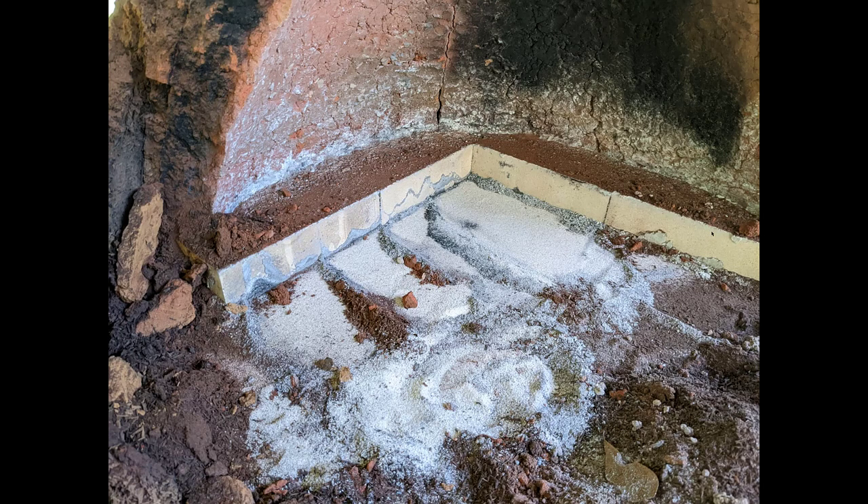I have some pictures of the inside of the dome, but they look just like they always did. This was not a mystery. We can see that there are cracks, and now we can actually confirm the cracks did go all the way through the layer. We kind of knew that anyway, because when I fired it in the beginning I was starting to see steam coming out of those cracks on the outside — that's why I added the second dome. After removing the fire bricks, you can see the sand underneath them, and then the thermal mass is under that.